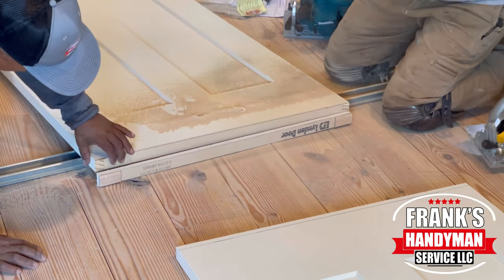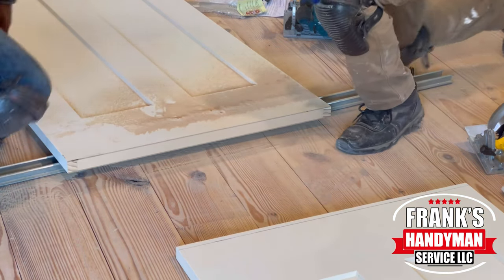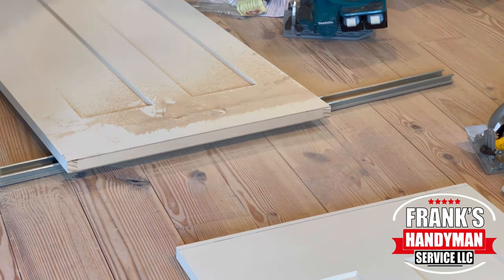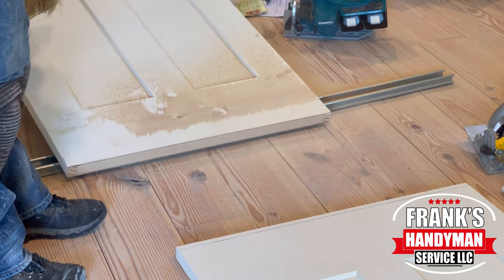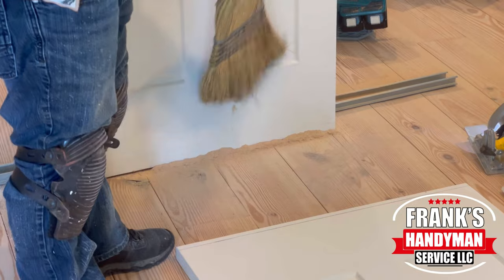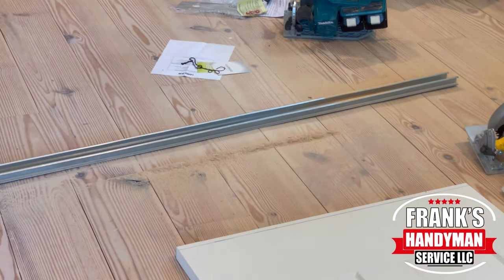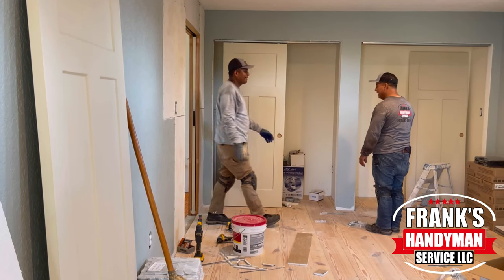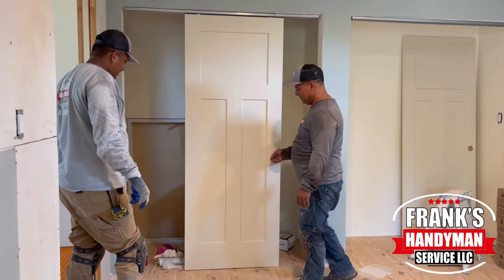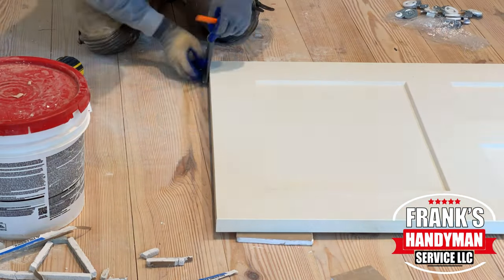The only thing that will be needed after that is to put on the little plastic guides at the bottom — I'll show you that in a little bit, how we installed that, and I'm going to give you a tip so you can make sure to do it right the first time. All this sawdust we're picking up with a dustpan collector, just trying to keep the area clean. Afterwards the flooring guys are going to clean up the floor and sand and finish it. But there it is — perfect fit. It slides nice and even all the way through.